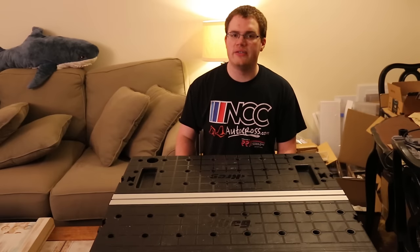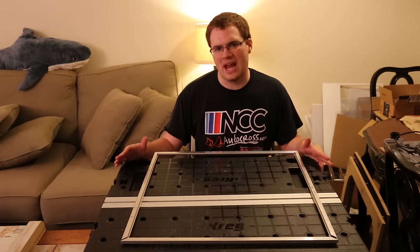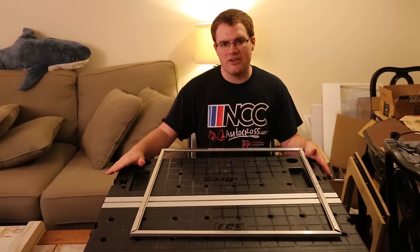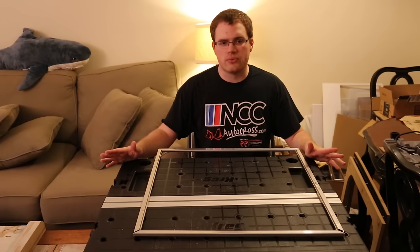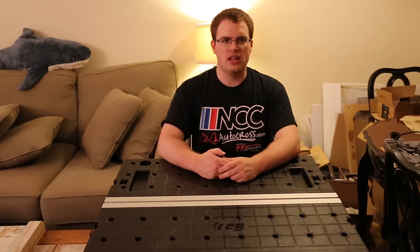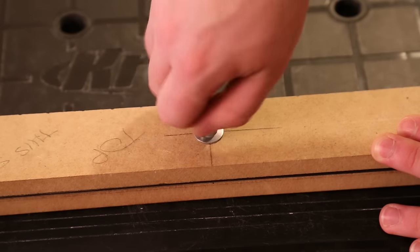Frames carry your plastic and there are a few different types. For toaster-oven scale, cutting a window in a toaster oven tray may be the perfect way to go. For mid-size forming, you can utilize aluminum window screen frames, though I found they have a tendency to twist and have a difficult time creating an excellent seal on the platen. Hot aluminum frames might also melt gasket material. I think aluminum frames may perform best on a platen with a curved-edge draw-over style. Instead of aluminum frames, I would suggest using half-inch MDF sheets with the center cut out. For clamping hardware, large binder clips work for toaster oven trays or aluminum frames; for MDF sheets, I suggest some form of bolt and wingnut arrangement.